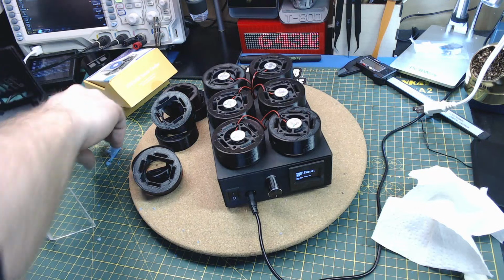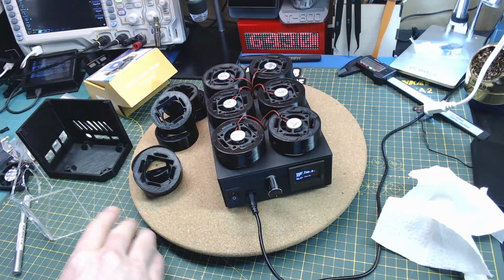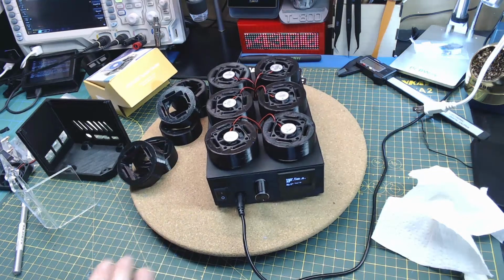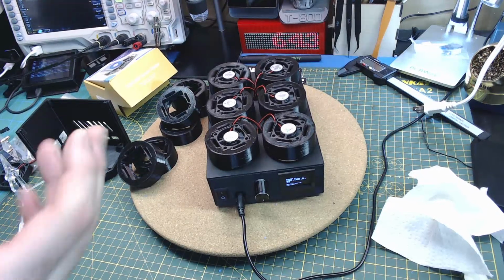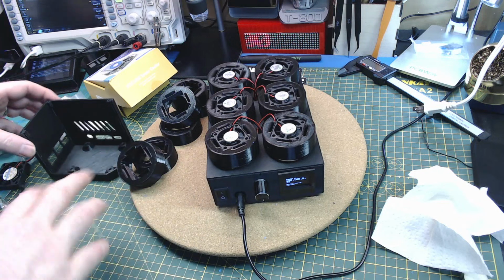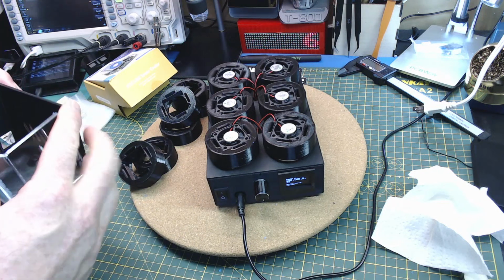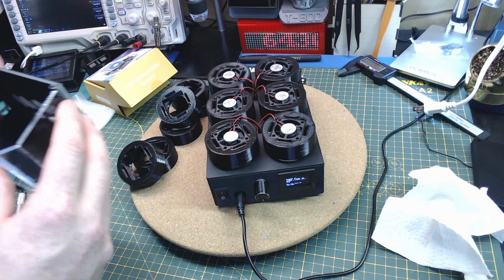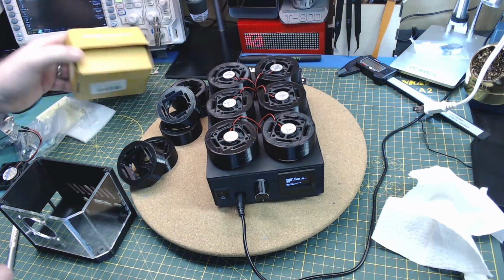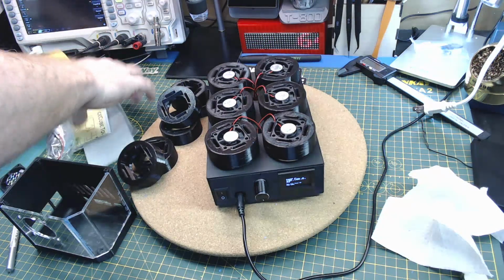I still have to reflow them because I used some SMD components for the LEDs and stuff, but it's such a tiny amount. It's super easy, and the pick and place only takes minutes. But the through hole stuff, I can bang that out really fast, much faster than I could with SMD. So the price is cheaper and I can do it faster, so that works out pretty decent.